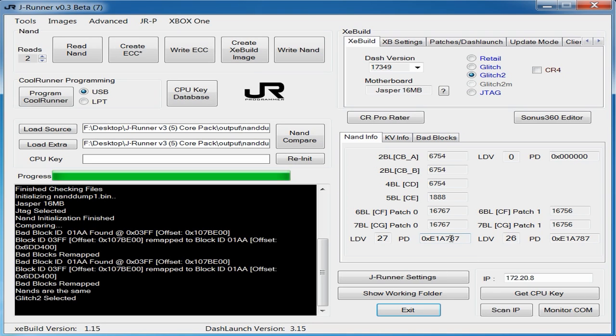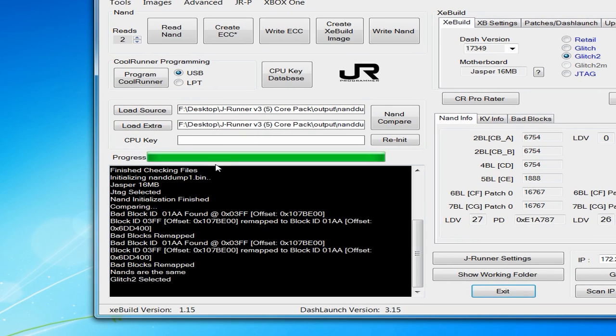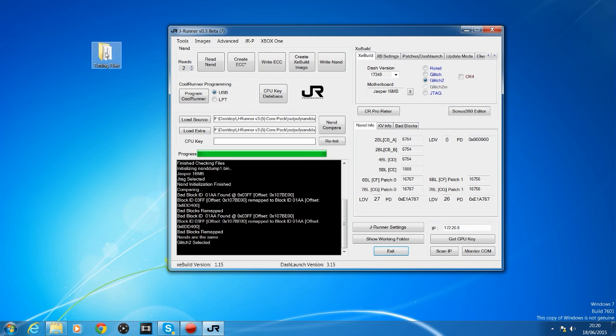We're doing the RGH1.2 hack, which is a relatively new and unheard of hack, and therefore there are no preset timing files in JRunner yet. There may be in the future, but right now there's not. So what we're going to do is add our own custom timing files for RGH1.2, which I have here, and I'll provide them in the description.